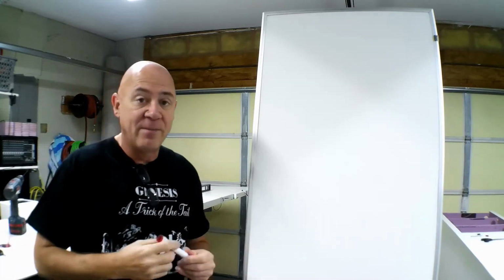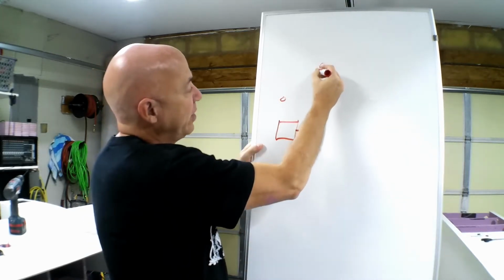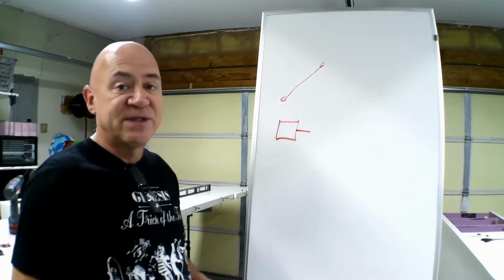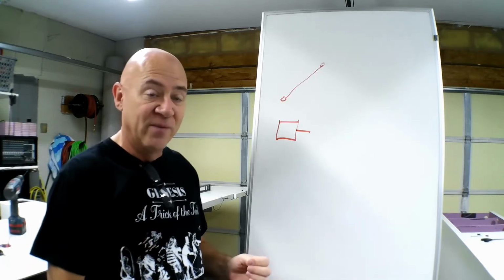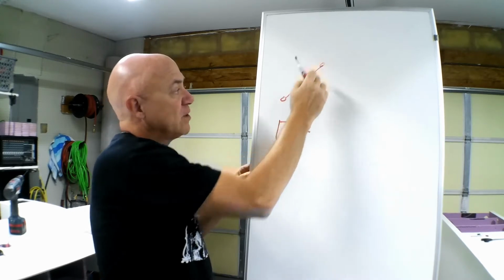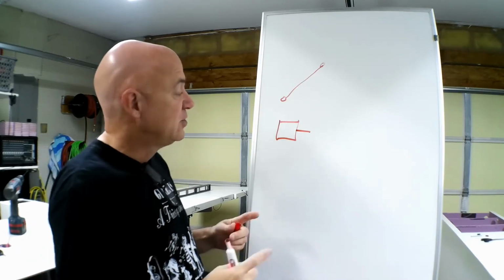So let's talk for a moment about an electric motor. Let's just say that the throttle band is pretty much linear on an electric motor. If you look at the amps as they go up with the prop, you do lose a little bit of efficiency at the top, because the faster a prop goes, the less efficient it is moving through the air. It takes more oomph. The drag is squared, if I remember my math. So when the electric motor goes up, your amperage is linear, but the forces it takes to turn it at the higher RPM are much more resistant. It's harder.